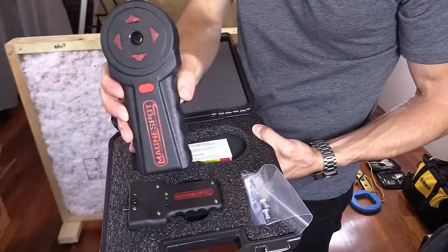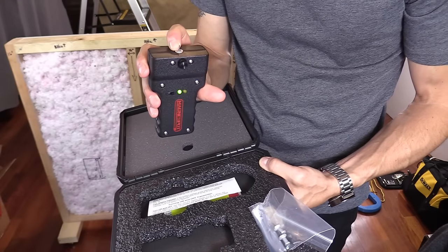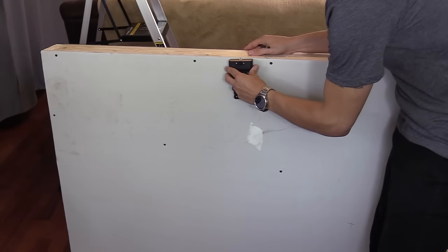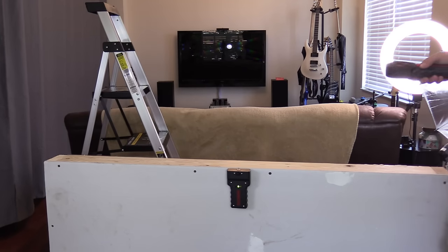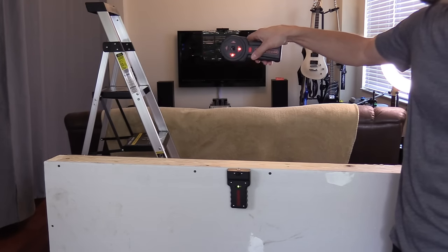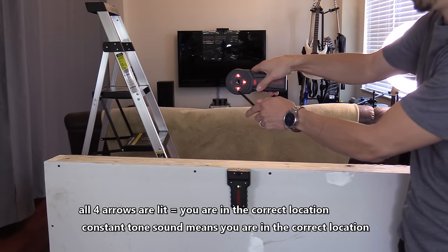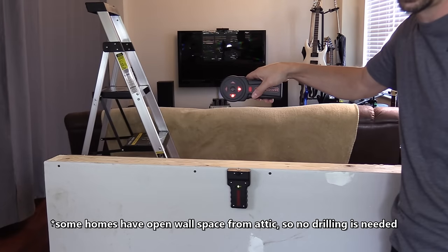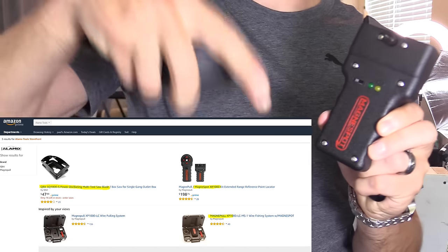This right here is the receiver — it uses a 9-volt battery — and right here is the transmitter. It has a tack so you can stick it to the ceiling or on the wall. It also has tacky tape included in the case. So if you're in the attic, you walk in and even if you're two feet above it, it'll let you know where the transmitter is. You can see the arrows lighting up, and that lets you know exactly which wall space you need to drop the cables down and where to drill on the 2x4. If you're interested in this device, I'll leave a link in the video description below.